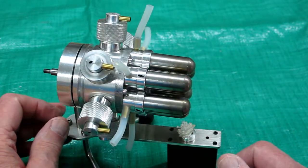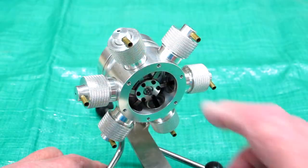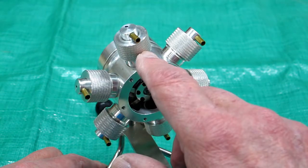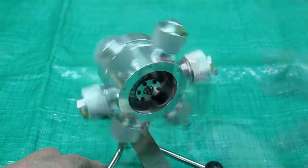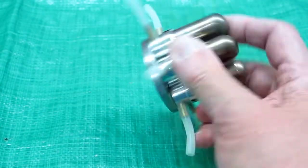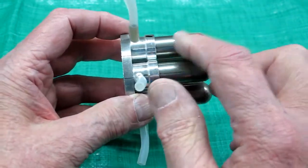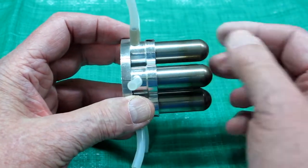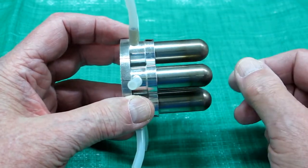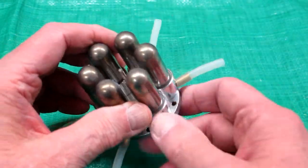Maybe it's got some dirt in here or whatever. As much as I don't want to, I'm going to take this hot end apart. I took each of these apart and looked at the piston, the liner, and the O-ring, and they all seem to be okay. Those displacers are moving, but you can't tell how many. They have to be very free — they have to move with a very small differential pressure by the piston or by the heated gas. I took a wire and put it up in there, and each one is free to move.